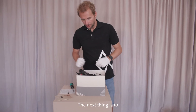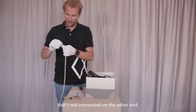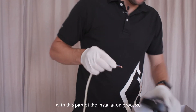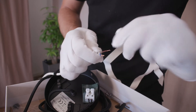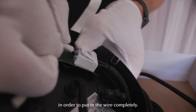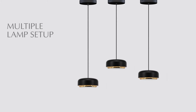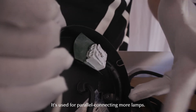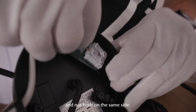The next thing is to finish up the electrical connection. I have a piece of wire that is not connected on the other end, but just for the sake of the video I am going to show you how to install this end. If you are not comfortable with this part of the installation process, I advise you to contact your local electrician. One wire goes in N and one goes in L. You push down on this latch in order to insert the wire completely. On the terminal block, each side has two holes — this is used for connecting more lamps in parallel. Just be sure you put one in N and one in L, and not both in the same side.